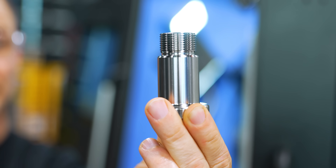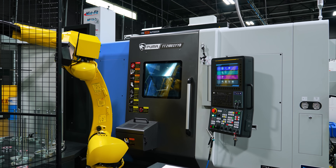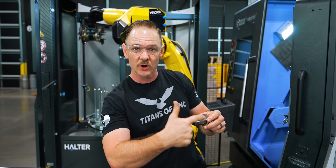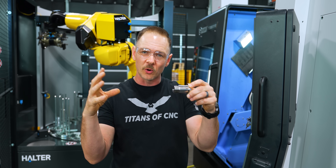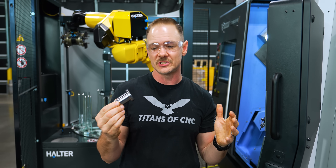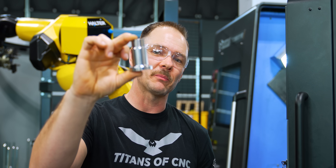This part came out pretty well. Some of you might be wondering why we're not doing a chuck transfer — the TT2100 is very capable of that — but I have some tight GD&T on this part. I have a datum on this face and a datum on the OD, and my jaws have a hole that's just a little bit wider than the front of this part when it grabs. I'm concerned about cocking due to the tight GD&T tolerances on the features I have to machine on this side. That said, I'm really happy with where we're at on Op 1. Let's go finish it with Op 2.